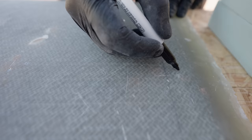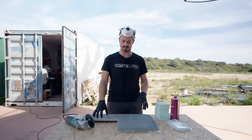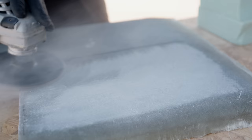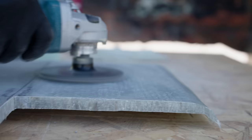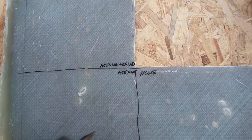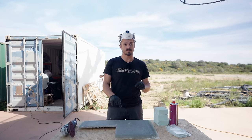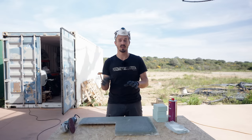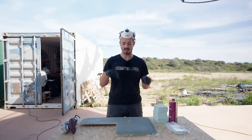We're going to do three different versions: bond directly to this side untreated even though it's a little contaminated; one section wiped with acetone that has the same peel ply texture; and one section where we wipe with acetone and then grind it down and scuff it up with 80-grit on a grinder. If you're going to grind, definitely wipe with acetone first to remove any wax and residue. Then grind to scuff it up and make the texture. If you grind first and then use acetone, you've just ground all that wax into every porous fiber and the acetone won't take it all out. So: acetone first, then grind, then wipe or vacuum the dust off.